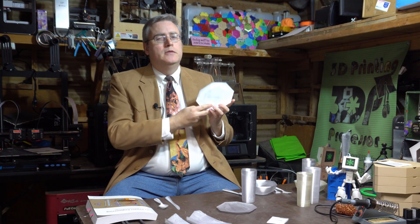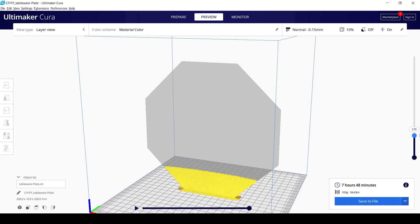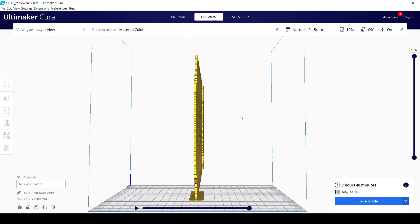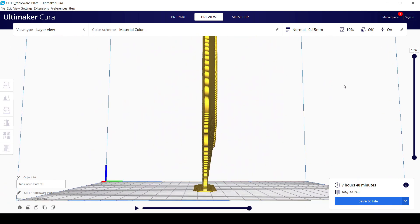But the plate presented an all-new problem. Because plates aren't actually flat — plates are actually just very, very shallow bowls. It needed to have a curve to it. And while I could have made the top gently curved and brought the bottom down at a 45-degree angle, it wouldn't stack that way very well. I just wanted it to be more like a traditional plate. So how do I solve that? Well, you might have already guessed the reason why this is an octagonally shaped plate — I am standing it up on one of these sides, and I needed a flat side. So if I had one flat side, I might as well make the opposite flat, and then do the sides. It just became an octagon. That also informed a little bit of the shape of the bowl, so this tableware set kind of has an octagonal feel to it.